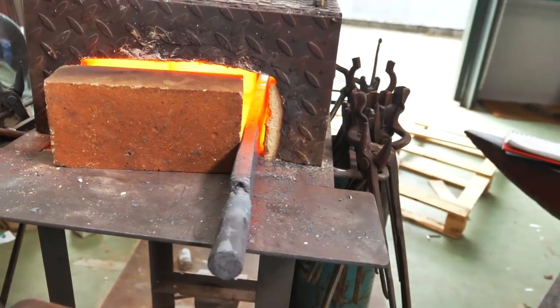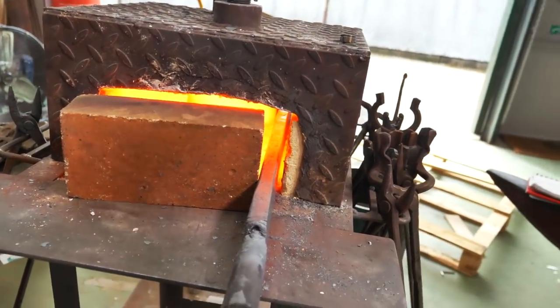As I let this cool down, I'm going to pass it through the forge so that it all cools down nice and slowly. This will give me a nice soft piece of steel to work with — when I go to the bandsaw it cuts easily, and I can grind it easily. I grind it so I can restack it, making sure the pattern is how I want it to be for the next forge weld, and also to clean those surfaces. Boy, does it feel good to have that hammer running and be throwing some sparks.